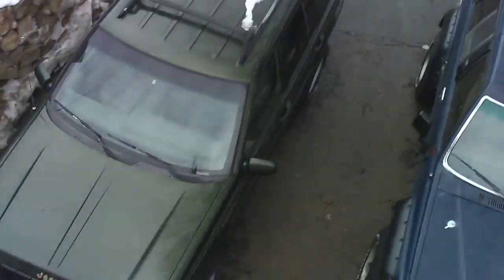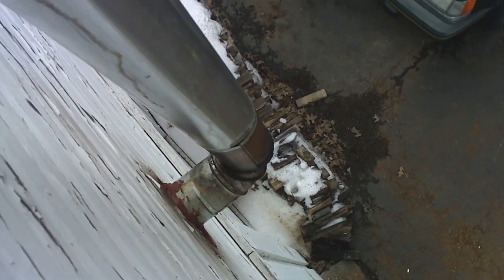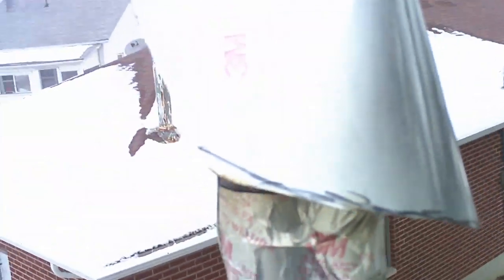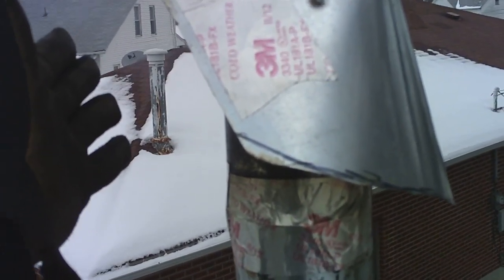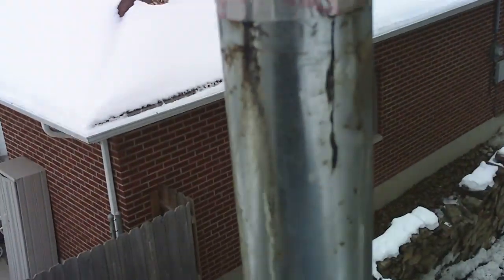You'll see a little bit of smoke come out for a couple minutes, but a lot of it's steam. You get a lot of that pellet gook — I don't know what else to call it. It's a brown, nasty stuff. It started discoloring the side of the front of the garage when I had the other windbreak on it. When I extended the pipe out, you get some of that runny, tar-y looking stuff. It's real sticky. It doesn't seem to really build up on the inside of the pipe, but it definitely drips. The smoke you see out of this thing is not wood smoke — it's steam evaporating out of the pipe and the stove.